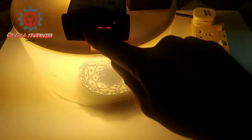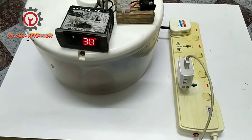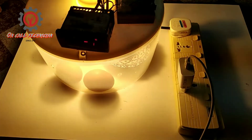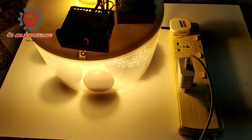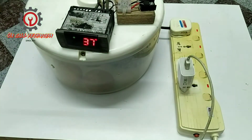Okay, it's working guys! The load for the compressor terminal is now activated. Now that everything is done, I put eggs in it along with water so the humidity will help hatch the eggs — not only the heater is needed. My unit is activated and it cuts off at 37 degrees Celsius, but the temperature rises up to 38 and 39, then drops and starts again.